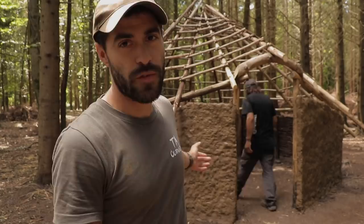It's because we have really mild, hot, humid temperatures at the moment. So there's a lot of contraction and expansion going on with the clay where it's absorbing all that moisture and then drying really fast in the sun. We are going to try and put some tarps on the top of it for the next couple of days. Hopefully we have enough tarps to cover all of it, but from experience with the Saxon house, it does help to let the clay dry slowly, and really that's what we want. We need it to dry slowly and not fast, because that's when it cracks. But it's middle of summer and we've had no rain at all really, so it's drying pretty fast. But it is what it is, we're enjoying it.